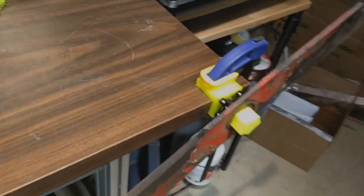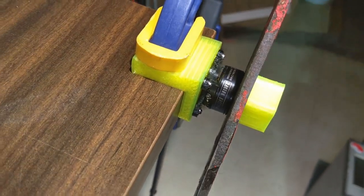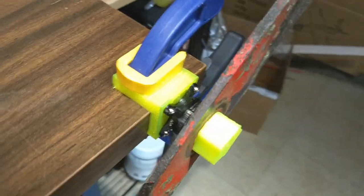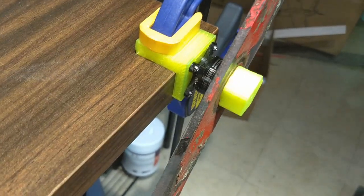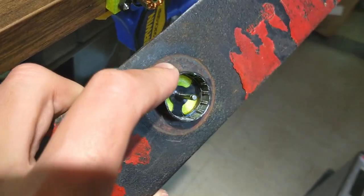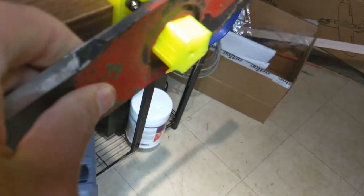The actual setup is really straightforward. I've got an old Cobra motor. These things are notorious for throwing magnets because the epoxy would let loose, which is perfect for us because we don't need them. Basically you just have two 3D printed parts, or you could just take some wood and fashion this together. Take the motor, pull out the C-clip at the back, if it's got a holding screw, knock out the magnets. Attach it to the front.